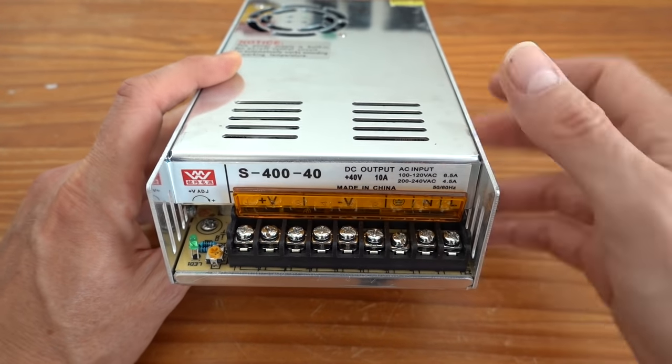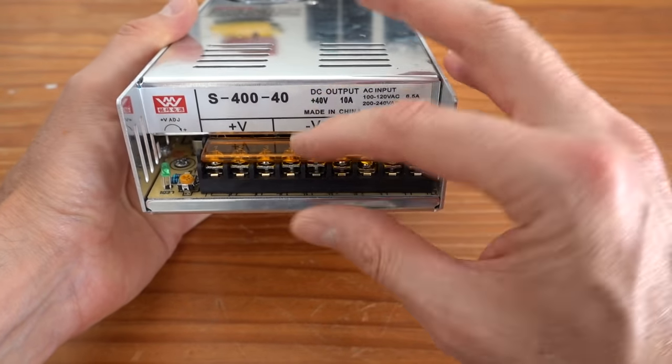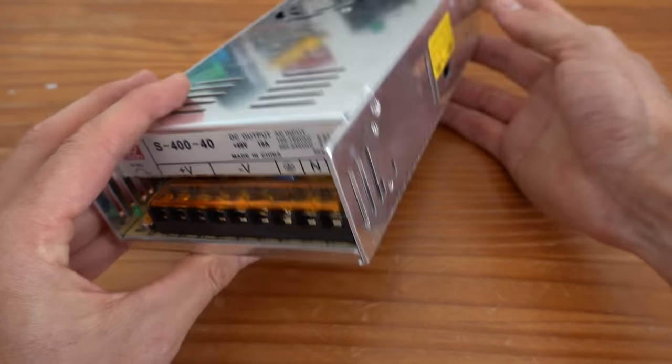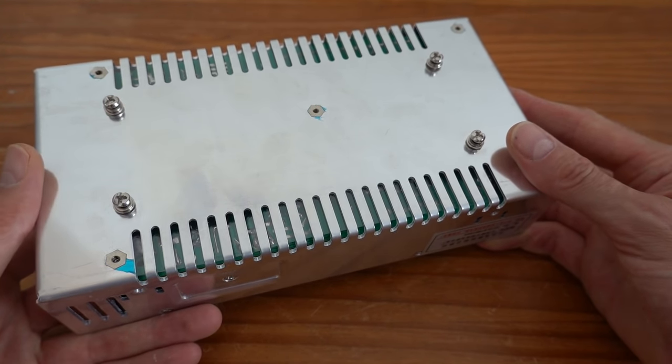Also, as I understood, there's a rule of thumb that states that you can use a power supply that is rated to 2/3 of the stepper's phase current. So for having four motors rated at 3 amps, it would require an 8 amp power supply. So unless I run into any stability issues, I will not change anything.